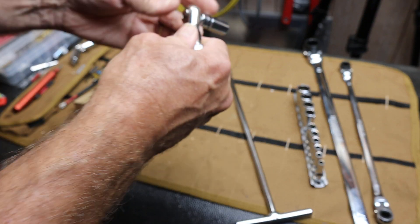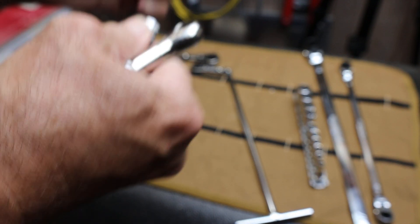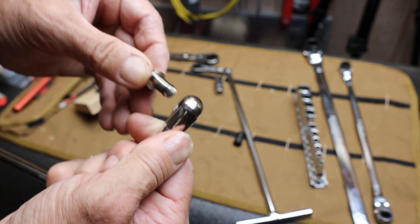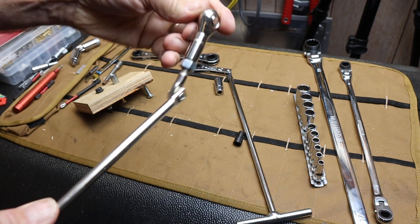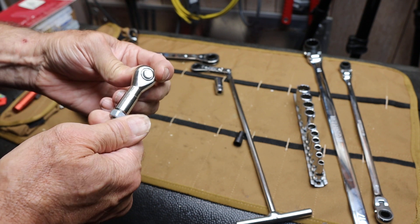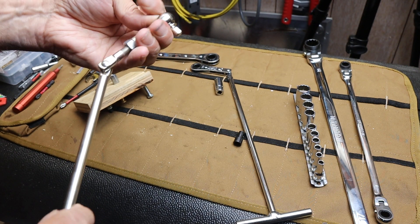This particular head has an insert. It's got this gearless ratchet — it almost looks like roller bearings in there — and it has basically zero back drag. It comes with two inserts: one's a quarter-inch square for sockets, and this one's a fixed eight millimeter. They have a little o-ring on the back and drop in on either side. You pop it off, flip it around, and now it works to put something on or take it off, whichever direction you need.